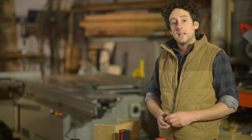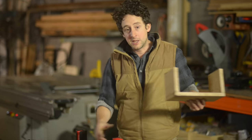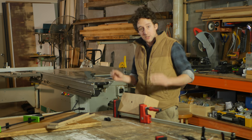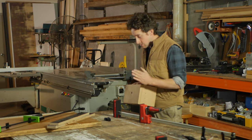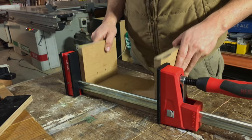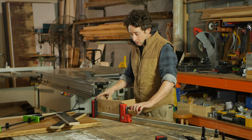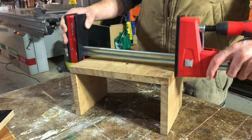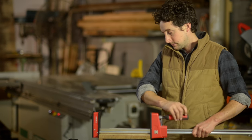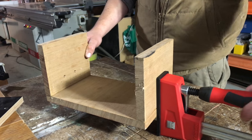The really large flat clamping face gives you a ton of versatility. With an F-clamp you'd need to place those two clamping surfaces right on the edge you were trying to join. With these larger parallel clamps, that entire surface is your clamping area. That means you can place the object to the side and get good clamping pressure on a really narrow edge without applying pressure somewhere on the panels that's going to fold the object. You can also use the bottom face when working on thin panels flat on a table, clamping down from the top, applying pressure in an even and parallel way that won't fold those edges in.